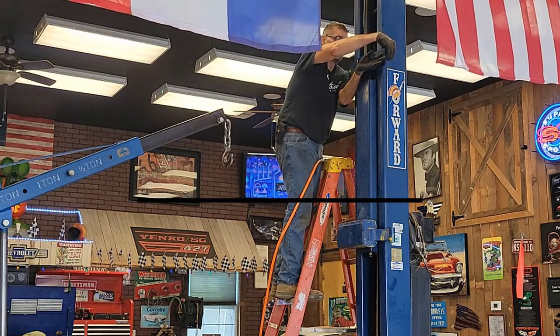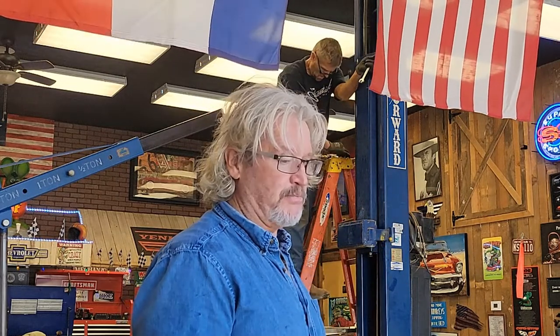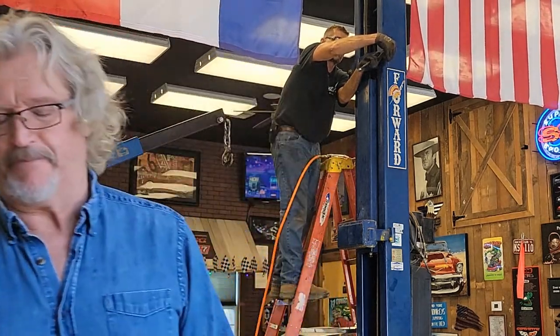That's basically it. We're going to raise the hoist up until the jacks are all even, but we don't have any oil with us and it's Christmas Day, so we're not going to fill it today. This is basically the gist of replacing the cylinder. You've got to fill it up — it's going to have air in it. Run the hydraulic pump until you get the air out; the air will pump into the tank and float to the top of the oil. Keep running it until the air is out. That's it for replacing the cylinder on a Forward Lifts 9,000-pound lift. We've been doing this about two to two and a half hours. Thanks for watching.